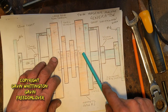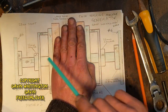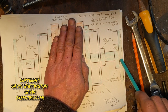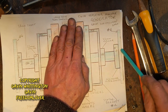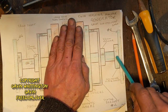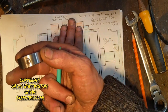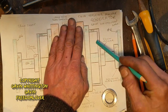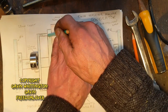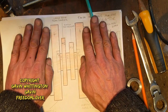Both magnet rotors rotate and everything in between them — that rotates around the shaft. Everything here and here is fixed and doesn't move. Either side it will have a plate coming down from the frame, and then some kind of device to keep the shaft in place, perfectly aligned. Something like this is perfect — both sides are the device, and that will hold the stator in place. So all that stays still and the middle section rotates round.